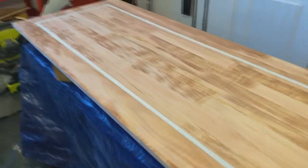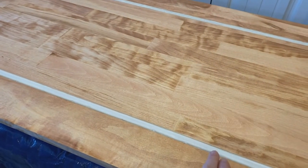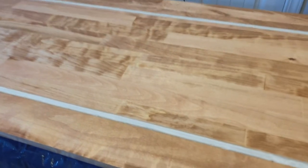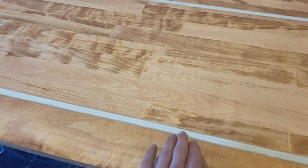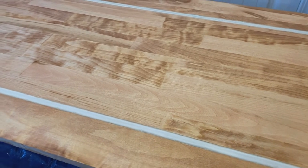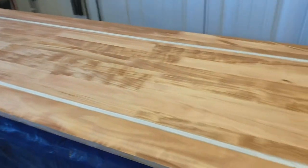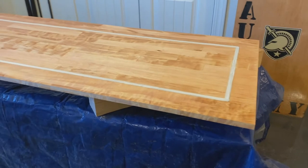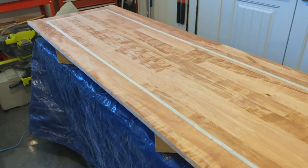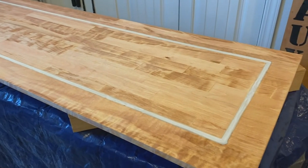Another note I wanted to add, something I know I talked to you guys about, how to deal with your resin as you stain the wood, like taping over it, whatever, like I did. That tape wasn't perfect, and some stain, I mean, barely any, but some stain leaked onto the epoxy, and you would see little spills, it looks like, on the epoxy once you remove the tape. So this may, and I'm saying strong may here, work if you were to just apply stain over the entire piece. I think it would be a lot more work than just putting tape down, spending 5 minutes doing that.